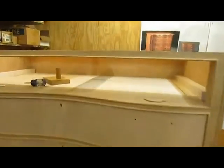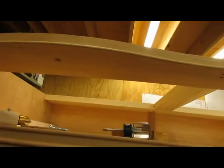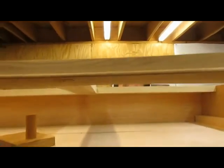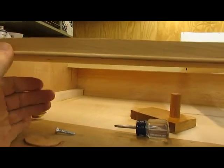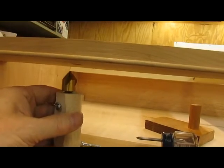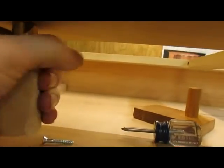In the meantime I thought I would mount the top onto the chest before we do final finishing. Here it is — I've drilled some holes, you can see it, to put some screws in from underneath. They need to be countersunk but because the drawer is so narrow I can't get any of my drills in, even with the 90-degree or 45-degree. So I've got my bit here in a block of wood so I can use it by hand, the way it was done in the old days.